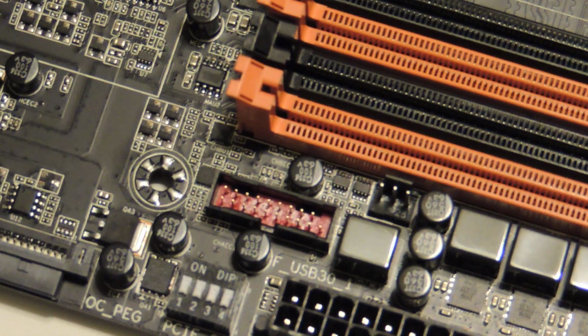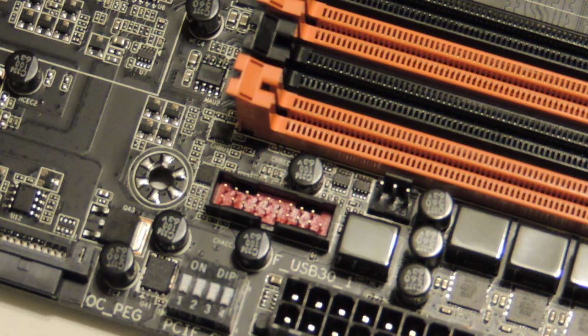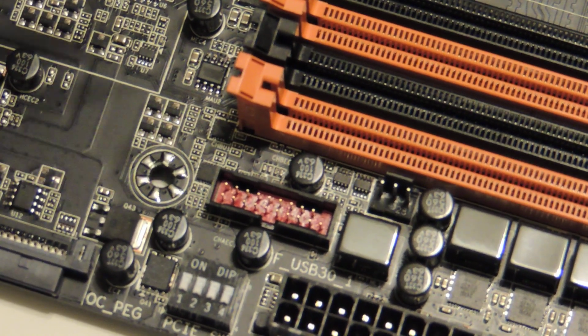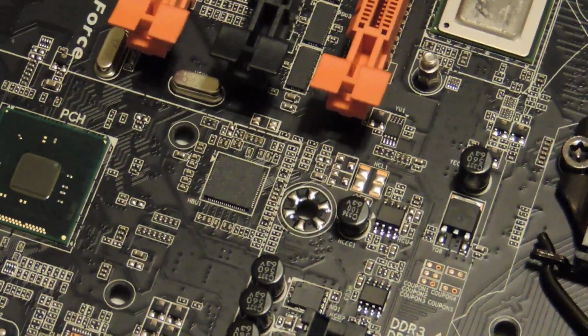And then here we can take a look at the USB 3.0 slot. This is an on-off charge USB 3.0 slot, and we never saw this before on Gigabyte boards. However, this time we're seeing this. And it's supported by 2 chips here. They're TPS2546, and they're specially made just for fast charging of USB 3.0. And you would need them to do on-off charge of USB 3.0 and the fast charging. Here we see the extra MOSFETs for the PCH VRM, right? Okay, that covers most of the VRMs.